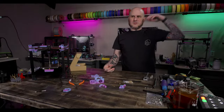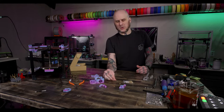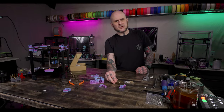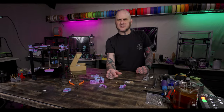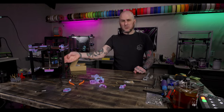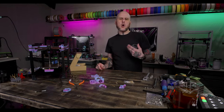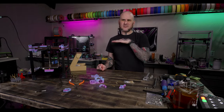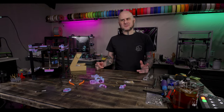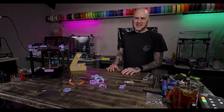I would do a Nevermore, the V6, because you can use that for cooling, but you don't always want cooling. That's the problem. You don't always want the additional cooling that fan airflow adds. So on this, I would always recommend a straight. We are going to be putting a Nevermore in here as well, but I don't want that airflow. The airflow that comes out of the Nevermore is negligible, but enough that it could cause print issues when you don't want airflow. So, have to balance that.